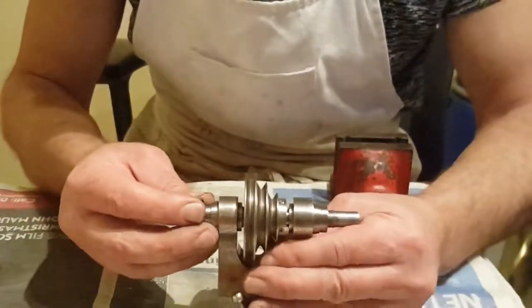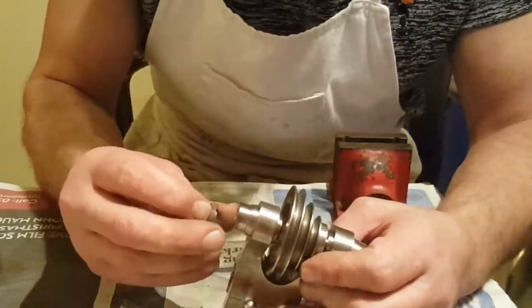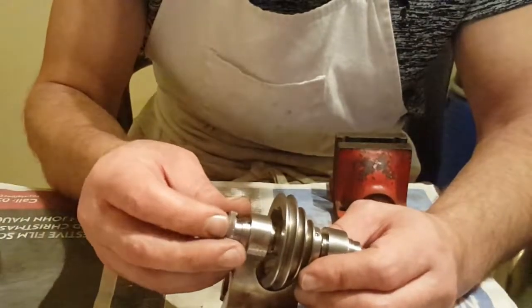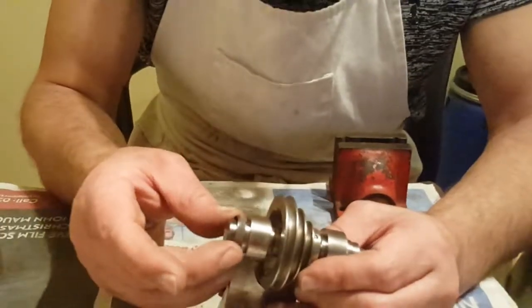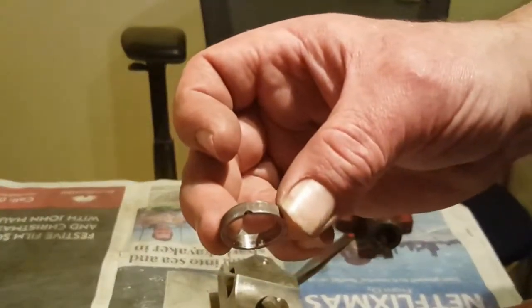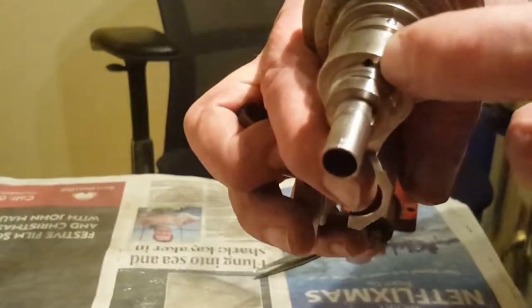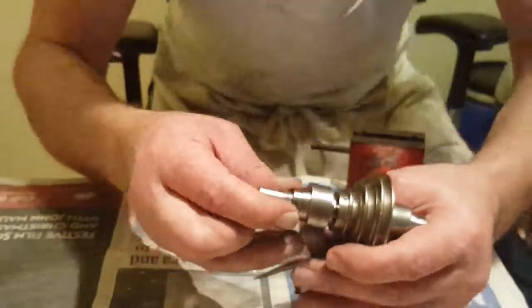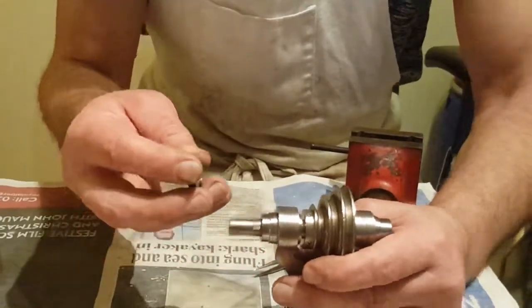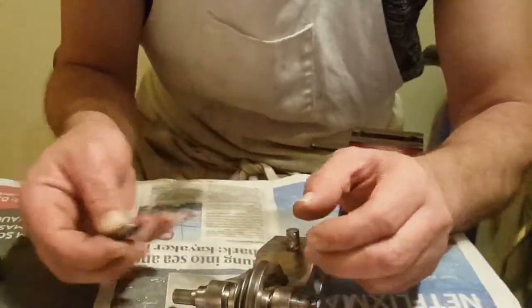On the outside dust covers you've got a little cut-out. Some headstocks have a little oil wick at the top that you can fill with oil — this is a lot simpler. You just put this sheath, this dust cover, over the top and line up the little cut-out with the hole. That's the hole that feeds the spindle with lubricant. On some headstocks you have an oil wick, a little container that holds the oil — not in this case. These dust covers have a split in them to help you pop them on, because they might be quite tight.